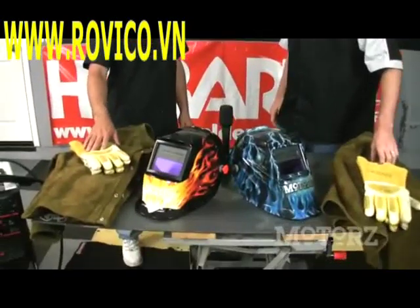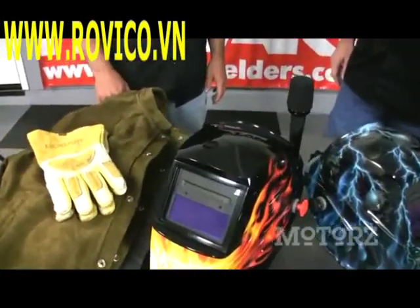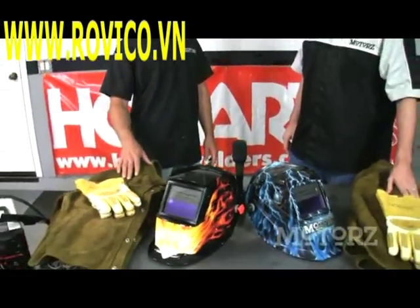So Brian, when it comes time to actually do some welding, can I just wear a t-shirt and some shorts and flip flops? Well Chris, it's important we have the right safety equipment. You're going to want a good sturdy leather jacket, a pair of gloves, as well as jeans and some closed-toed shoes or work boots — basically head-to-toe coverage. There are two important reasons: when you're welding you'll get some hot slag coming off your welds, and there's also UV light from the arc itself that can actually give you a sunburn if you're not properly protected.